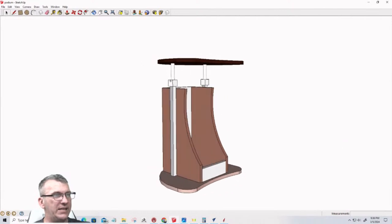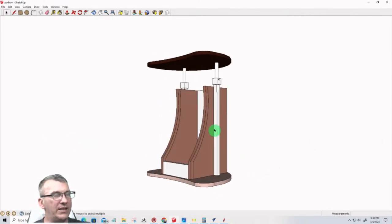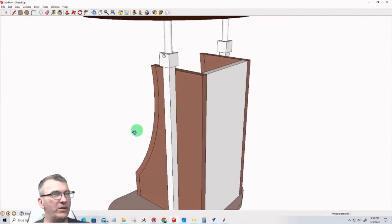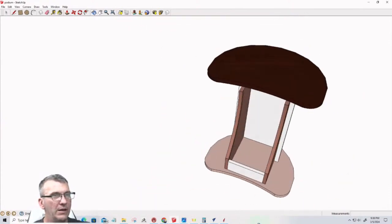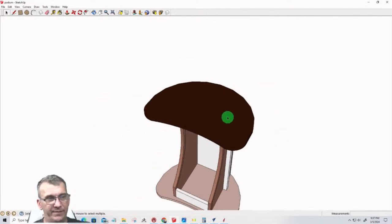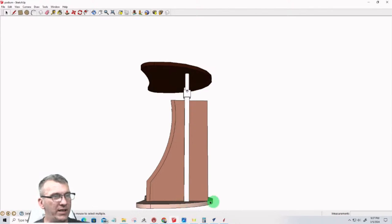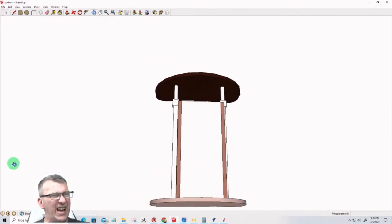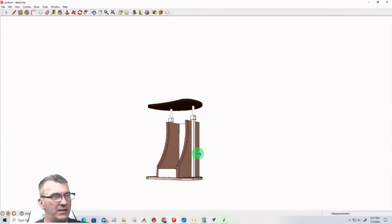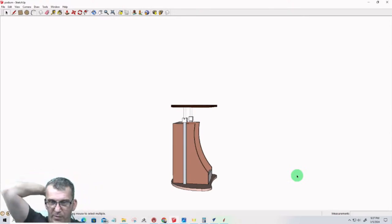what we will do in the next class is have all of the vectors for the drawer fronts and the drawers. We will get those imported into V-Carve or Aspire, whichever one. We will create the tool paths to make all the cuts for these. Now these panels here are 22 inches by 16. They're going to be glued up panels. This is 21 by 12 and 3/4, 21 inches by 12 and 3/4 for the side there. So every bit of this could be made even on a small CNC. Nothing would exceed the cutting area of even our 1824, which could cut all the parts for this.